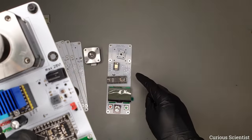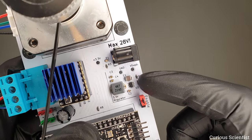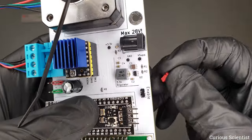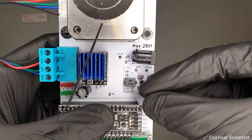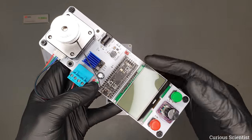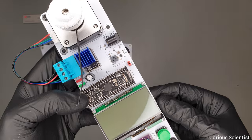And then one thing I did not show with this board in the background, because it's hard to show the components. Here I have my small buck converter, which converts the input voltage to 3.3 volts. And with this small jumper, we can connect the output of this 3.3 volt source to the rest of the circuit, like this. The reason why I did it is because sometimes you want to have the board as I show it right now, and you want to power the motor, and at the same time you want to connect this to the computer because you want to program it and test it.